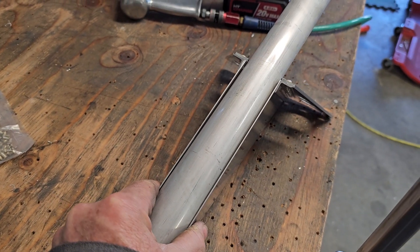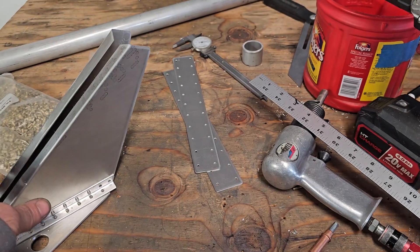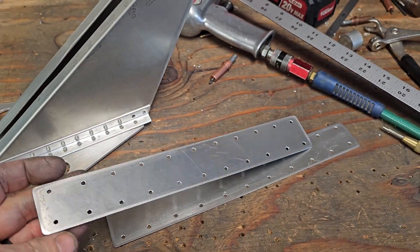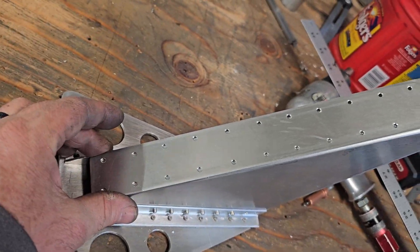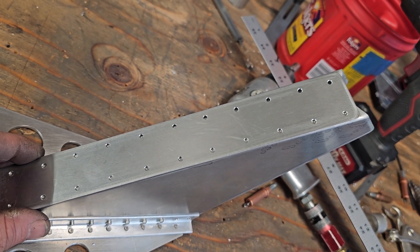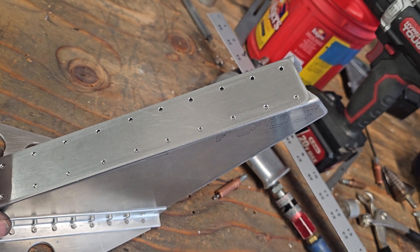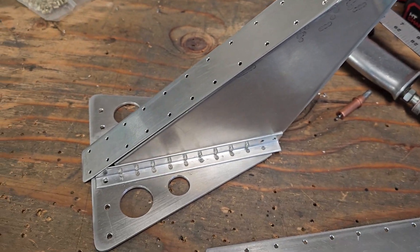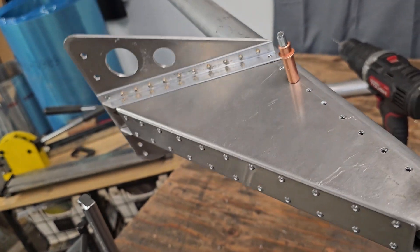After all that riveting you end up with a nice tight fit around the strut. Now that the gussets are riveted on, went ahead and made my two little pieces to box them in — drilled those, they'll go right along the back. It does taper down because this end is a little bit narrower. We'll match drill them into the gussets and then put those on with the Type 2 Avex rivets, and there we've got a boxed-in landing gear.